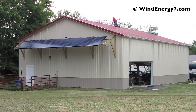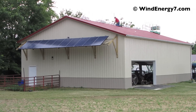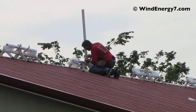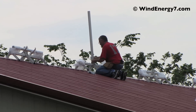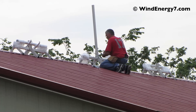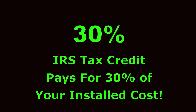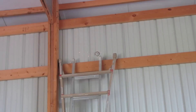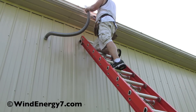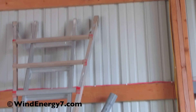There you can see the PV that we put up the other day — 10 panels in a south facing solar awning that we built there. That's going with the five turbines on the roof. The mounts are being installed now. You attach the legs to the mounts, then get the mast up all plumb and then drill it down into the roof. On the inside wall we made our penetration with two inch conduit — we're going to run two inch conduit down and then come down.